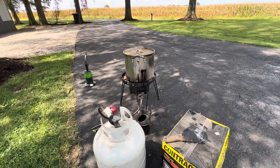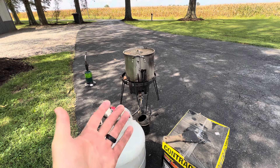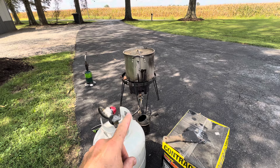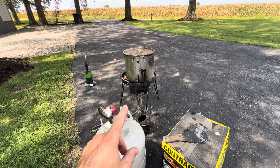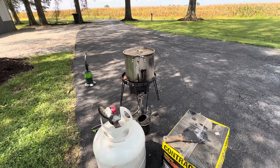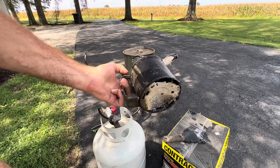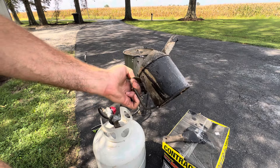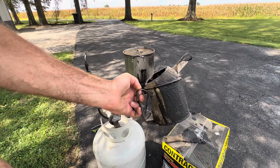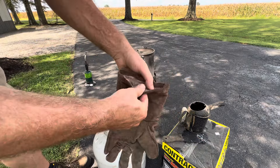Now, when you're heating the sealant up, you don't want to put the gas on full wide open — you want it to heat up a little at a time. Last time I did this it was late fall and windy, and it took longer to heat up. Today it's low 90s so it'll warm up pretty fast. You're going to need something like this metal one-quart funnel, and something that can handle heat — we're looking at around 250 to 300 degrees minimum, up to 375.